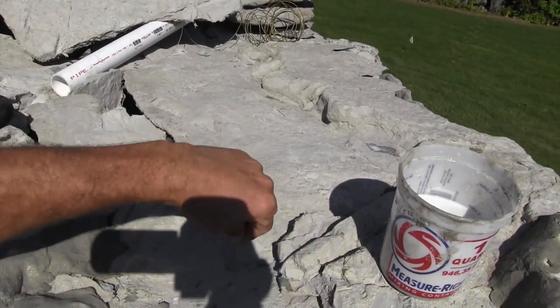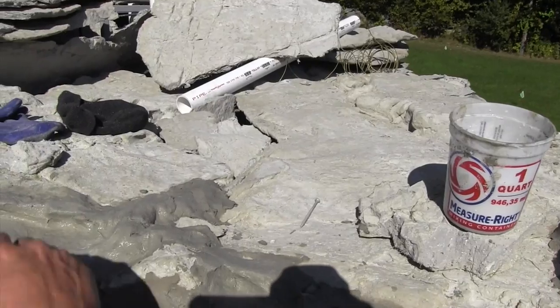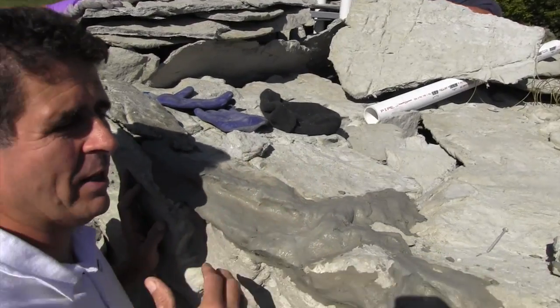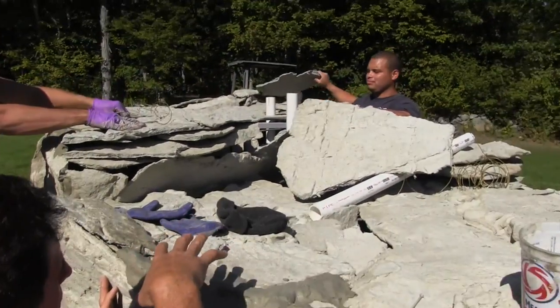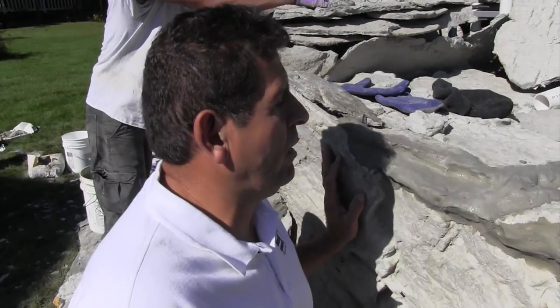A lot of times when you're making the panel, you forget that there are little pocks or little holes inside there. Sometimes the water will go through there. We'll leave a little bit of the back open, so when they turn on the water, you can look through it and see if it's leaking, and that's a good way to tell. Filippo from the back there will leave a section out so everybody can look through it and say, oh, there's a little leak here. Because it's hard to capture all of it and seal it up right away.